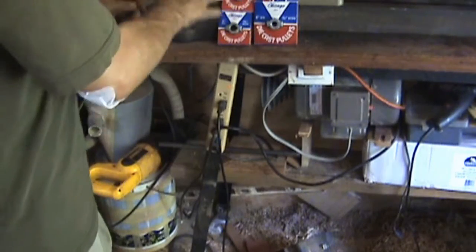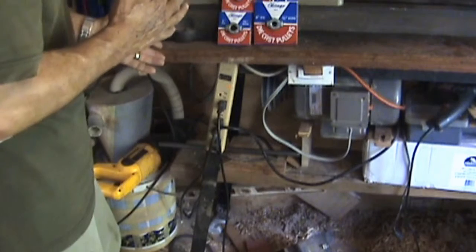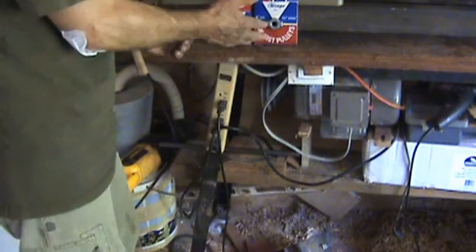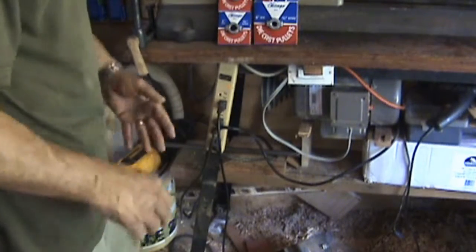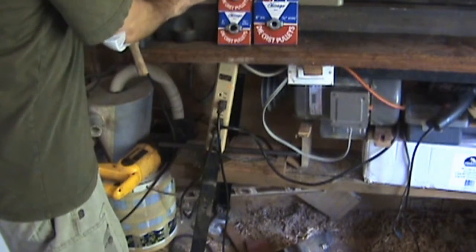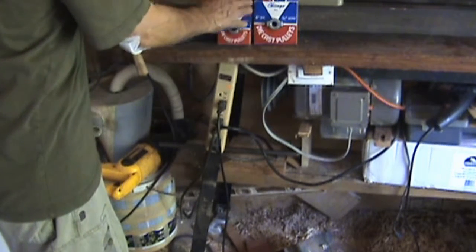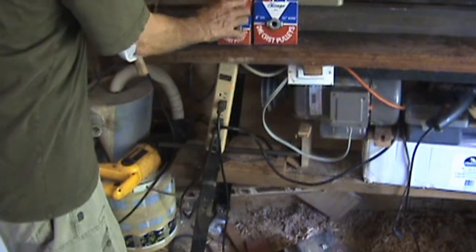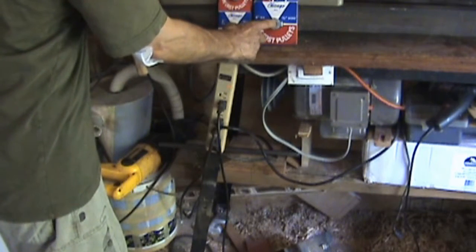So if my thinking is correct, I should be able to jump back and forth between the original speeds of the lathe and half speeds of the lathe. So everything will be able to follow up. And my thinking, of course, is that I'm going to be using this configuration most of the time. I just don't want to lose whatever features the lathe had just because I did a riser kit. But I also wanted to make it safer by reducing the speed. So the label that's here will be accurate with this configuration. And then I know that half of that will be accurate with this configuration, and half of that speed will be accurate with this configuration. So this is on a motor shaft, this is on a pulley shaft. Wrong again. These two will be on the motor shaft, these two will be on a pulley shaft.